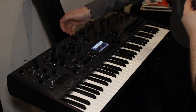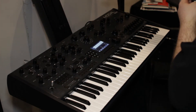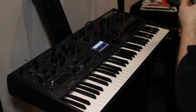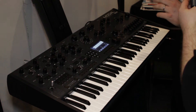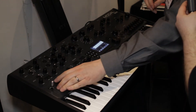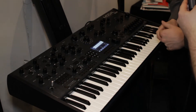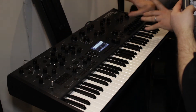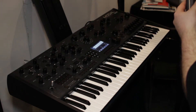So we're trying to bring back that flexible filter architecture. We've got two VCOs, two sub-oscillators, the VCF and VCAs for output as per normal. We've gone a little bit mental with the modulation matrix on this one. So you can modulate from, say, LFO 1 — I can turn the filter cutoff and it will modulate the filter cutoff. You can pretty much do any parameter, so you can have the LFO modulating itself if you really want to. You can do all these kind of mad things.